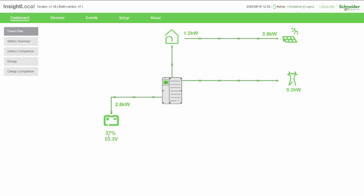We're charging away. Once the batteries are full, on a normal grid-tie setup the Schneider can't do anything and power would go right back to the grid. But we've got the GoodWe grid-tie inverter with CT clamps and zero-export configured, so if the Schneider ever stops charging, it'll actually slow down the GoodWe's output until it hits about 150 watts of import — preventing any export to the grid. If I had an interconnect agreement I could let it flow out for credits, but I don't want to do that here.